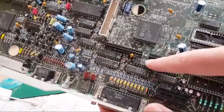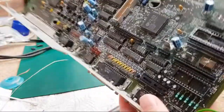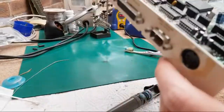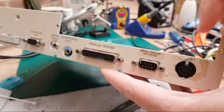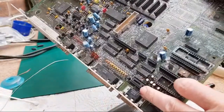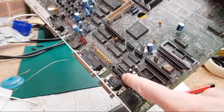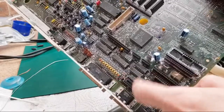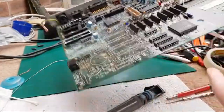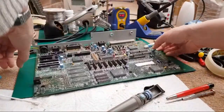If you look down here you can see the corrosion — it's got around this area here, looking a bit green, and there are some green pins in the socket. Something I've learned about these: the two sockets here look like they're for an optional serial upgrade — you can see it says 'serial not fitted.' I was fortunate enough that one of them actually had a chip in it — a ROM and some sort of serial transceiver IC. These came from Xavier, thank you very much.